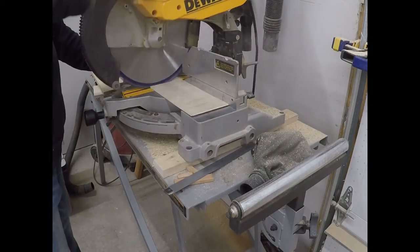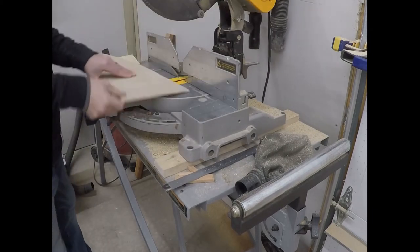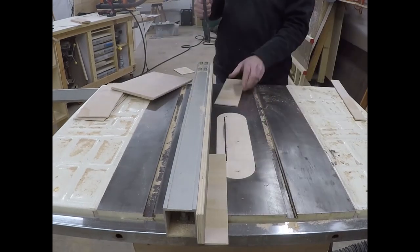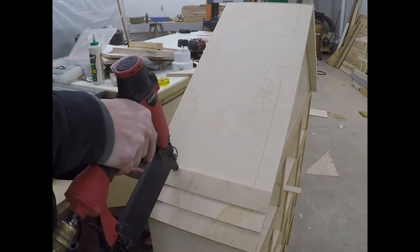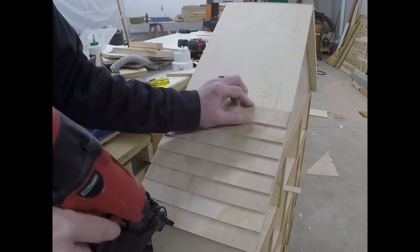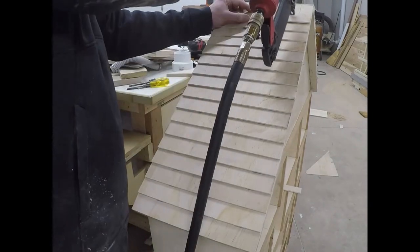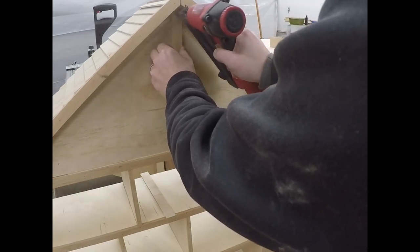I wanted to add a shingle effect to the roof of the house, so I took some 1/8 inch plywood and cut it down to 10-inch wide pieces. Next, at the table saw, I cut these down to 1-1/4 inch strips — these will act as shingles for the roof. After all of my strips were cut, I start attaching them to the top of the house. I put a quarter-inch overlap on each one, making sure not to shoot the nails past the overhang. A couple of the nails slipped out — I just cut them off with the wire cutters. On the front of the house, I take a 3/8 inch strip of alder and nail it from the peak down to the first piece of edging. This will act as a backer for the letter that I want to put on the house and makes it easier to put the front siding on.